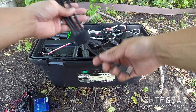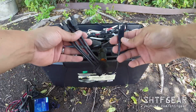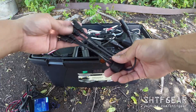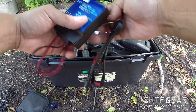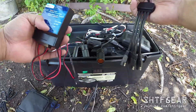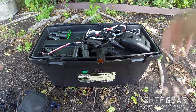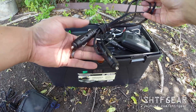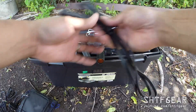There's an SAE 4-to-1 splitter or combiner, mainly used for charging. I can connect multiple solar panels, hook them up to the charge controller, and as long as it doesn't exceed 7 amps, I'll be able to top the battery box off. There's also a cigarette lighter male-to-male connector that will let me charge the box while it's in the car.